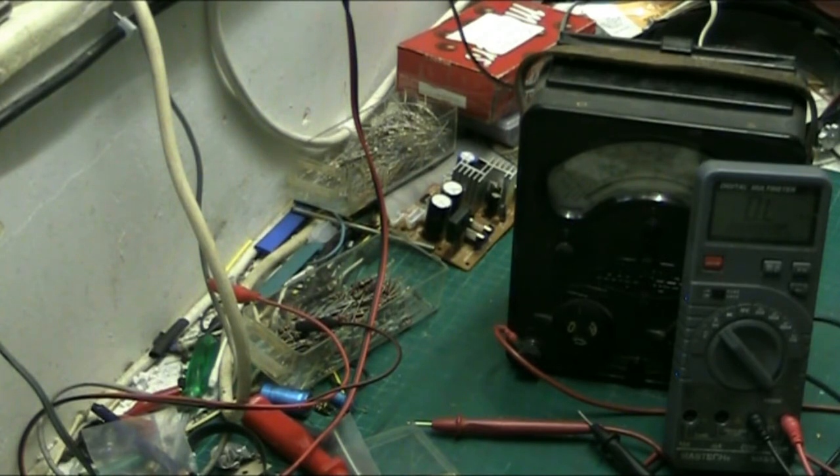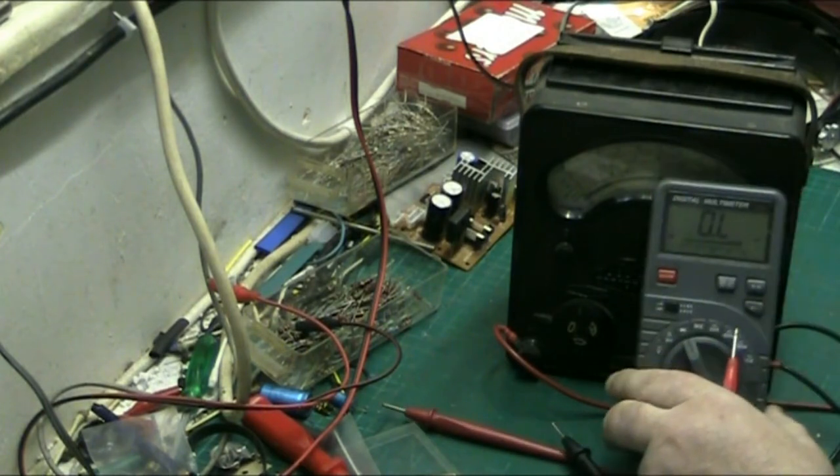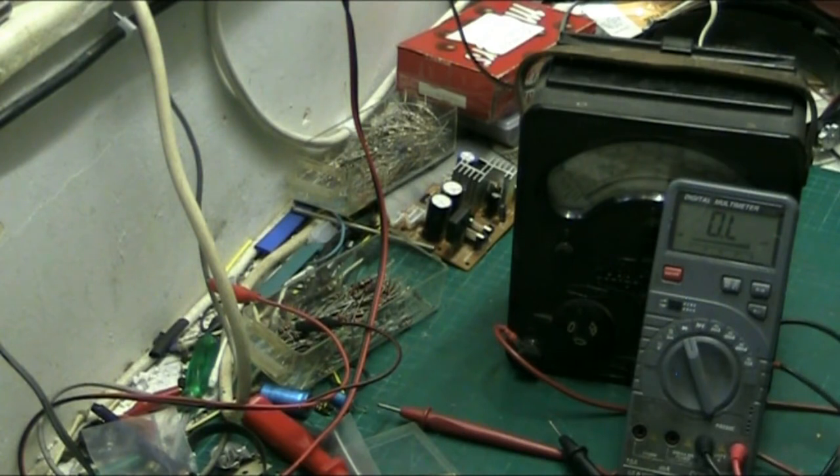On ohms, that's jumping around a bit - probably because it's picking up resistance off me. Nothing that side. We get our reading that side. But digital meters have a diode tester built in - they actually do have a diode tester. If I put the meter on the diode setting, it will put around 519 millivolts into the diode and that tells us the diode is good. If we flip the diode over - nothing. And that's what you should get from a diode on the digital meter.